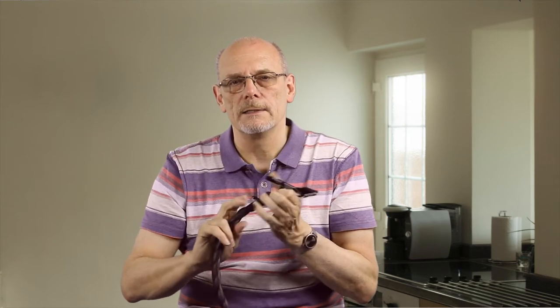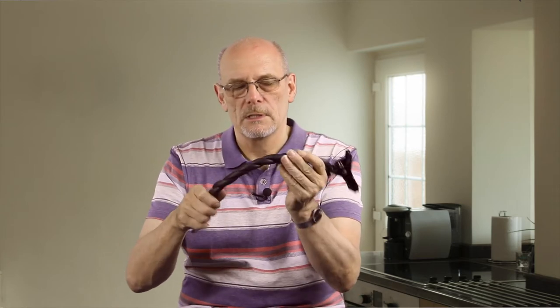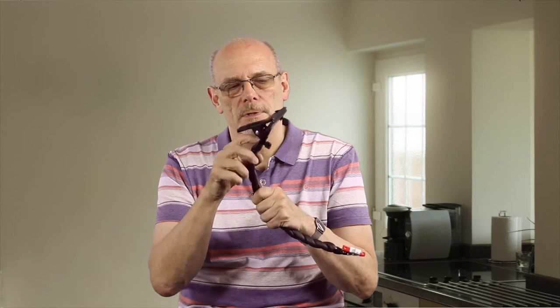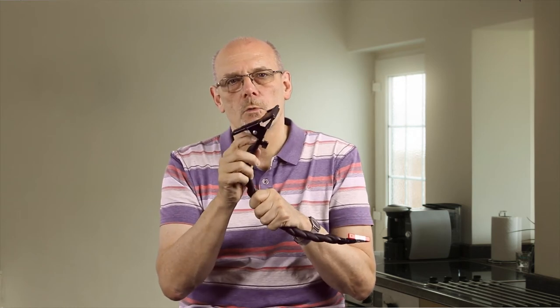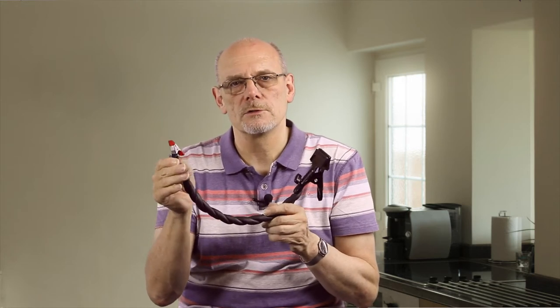Now, with the two ties together, it folds over, and it is a loop one end, and then you just twist it round so that it becomes entwined. This end forms a natural loop where you're going to put it to the clamp. You put through your bolt and your washer and make sure that the loop fits in the clamp, and you tighten it up, and then there's no lateral movement at all.